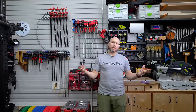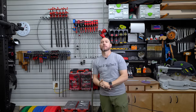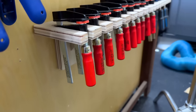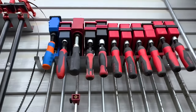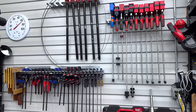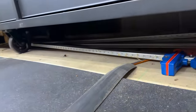When you first start out, you're only going to have a few clamps and you won't have to worry about storage much, but as a woodworker you'll love them and want more. You have to figure out a way to store them. I just made some racks out of plywood — for small F clamps you just cut slots and they fit right through. I also have these from Rockler that are made for specific clamp styles: one set for parallel clamps, one for bar clamps, one for F-style clamps. They're inexpensive, you just screw them into a solid wall. I also incorporated clamp racks into my mobile tool cart to keep clamps handy, and I even have some stored under my toolbox.